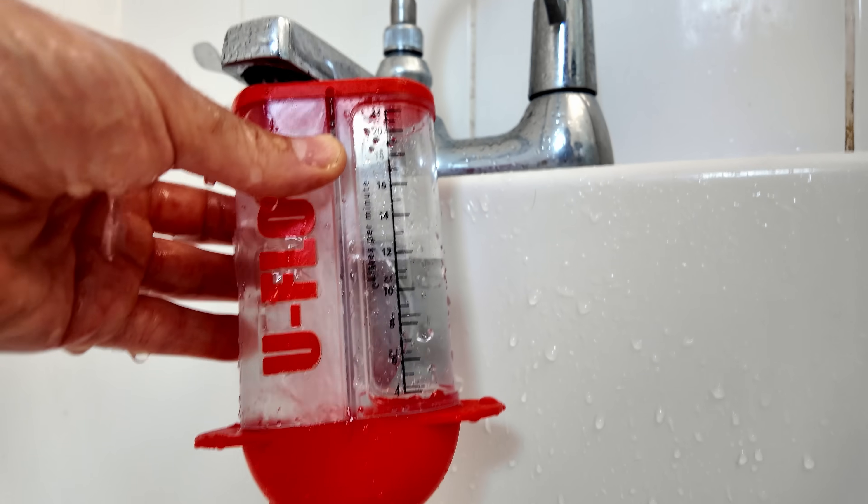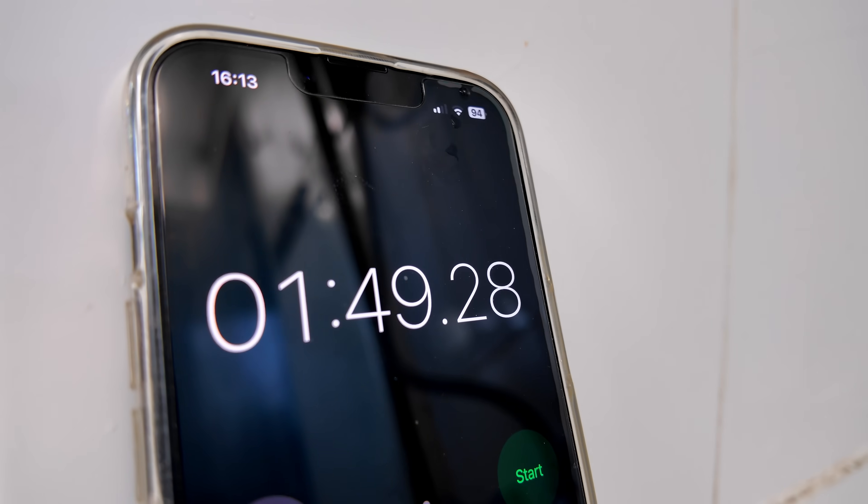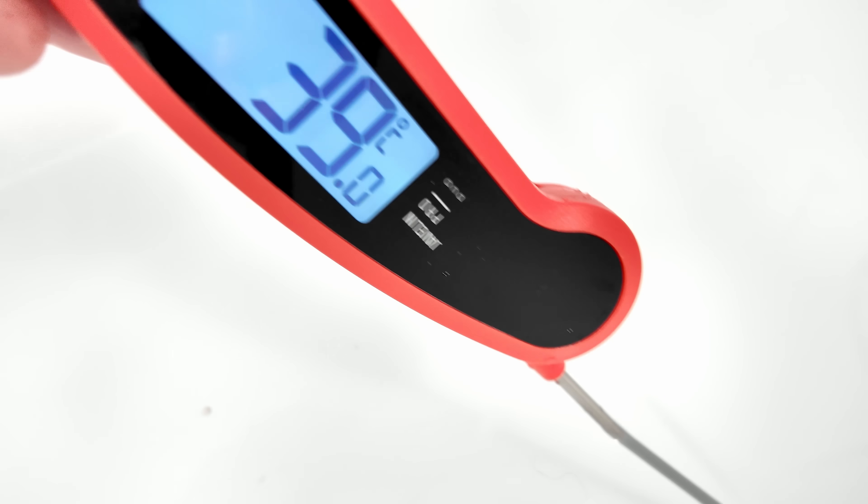The first test is going to be a bit extreme. I'm going to run hot water at full flow, trying to fill the bath, just seeing how much hot water we get. After around one minute 40 seconds, the temperature dropped below 38 degrees — not hot enough for the bath. We got around one third of a bath at 39 degrees, just about enough. I'm watching the Open Energy Monitor, which gives me the flow temperature of the heat pump so I know when it's fully recharged and when I can start filling again.